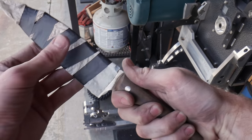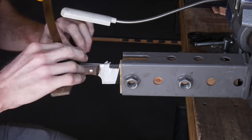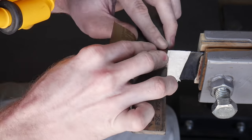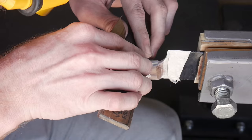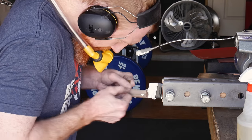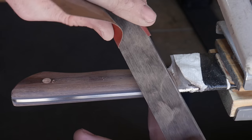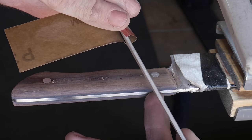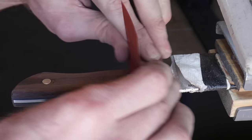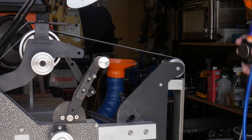This is about as far as I'll take it on the grinder. If aesthetics were not an issue this would be a perfectly usable handle, but aesthetics matter — so we'll bring this handle all the way up to 1000 grit, starting at 320, moving up to 600, then finally to 1000. When hand sanding the heads of Loveless or Corby fasteners, make sure you're using a hard backing — otherwise you'll dome over your fasteners and be able to feel that dome in your hand.